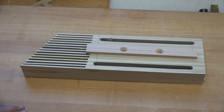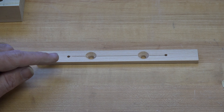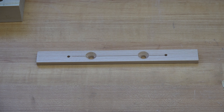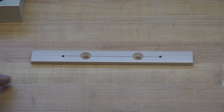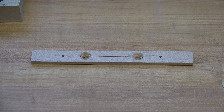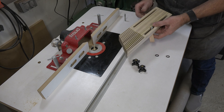You want to put the countersink in deep enough to sink the bolt flush with our miter slot track. Now it's time to cut a slot in this piece. We're going to take it over to the scroll saw and cut from approximately three quarters of an inch outside of one hole all the way through to three quarters of an inch past the other one. I'm going to use a number seven blade to get a thicker kerf. At each end of the slot I've drilled a 1/8-inch hole — the reason is it helps prevent this piece from splitting.